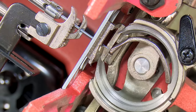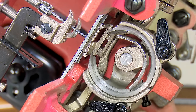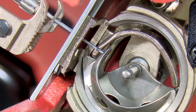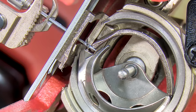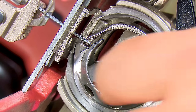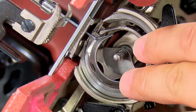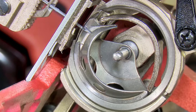Now let's go to the opposite extreme. I'm going to rotate the driver so that we're too far advanced. Now when I put the driver in and rotate it, notice the driver point is not even going behind the needle — it's right at the side of the needle. So if I go forward, it's not going back behind the hook far enough to catch the loop, so I would also be skipping stitches. Both of these situations would result in catastrophic stitching problems — no picking up of the thread whatsoever. Going even further forward: now the hook point isn't even going behind the needle before it changes direction. There I would never ever catch a stitch. Those are the wrong positions.